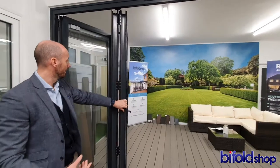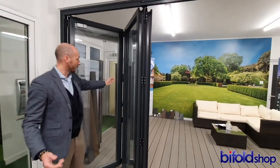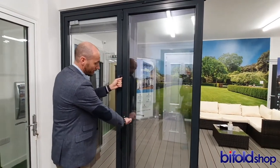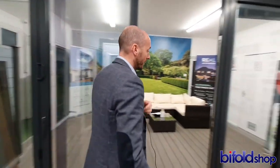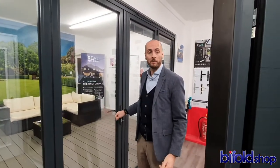Once you've opened, that's how to operate your doors in terms of opening. When it comes to closing, you work it in reverse — you start with the pair of doors first, slide them until it exposes the D-handle again, then pull with the D-handle and turn the shoot bolt handle into the fully locking position. Finally, take the lead traffic door off the mag catch into a locking position. Really simple, really basic top tip, but something that could save you issues when it comes to opening and closing your doors in the future.